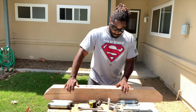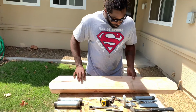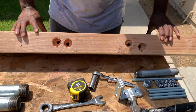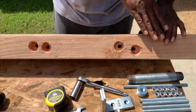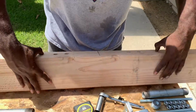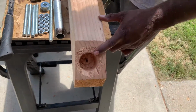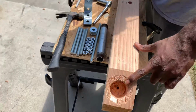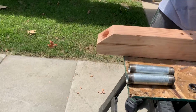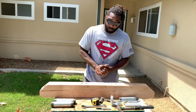All right, so as you can see here, we've done our woodwork. We've gotten the recess holes done for our underbelly to make sure that we're hitting only wood, not the hardware. We've blown out the 2-inch hole so that we can get our plate holders on there off of both sides. And we've already cut our all thread, so now it's time to put this bad boy together.